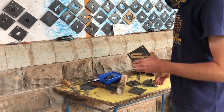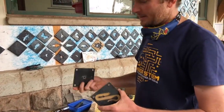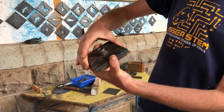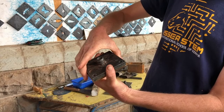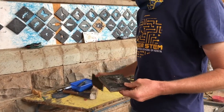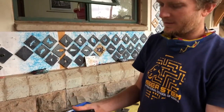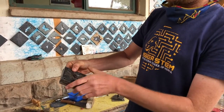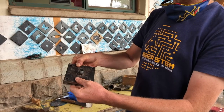Next, we have a top plate that goes on top — this is where the plastic is going to be pressed into. We line that on top of the mold, and then we take a bottom plate, which is just the holding plate that fits at the back. Then we're going to have four screws tightening around to hold the mold together.